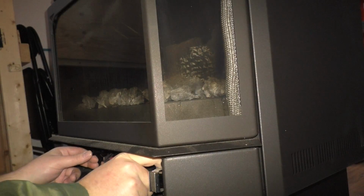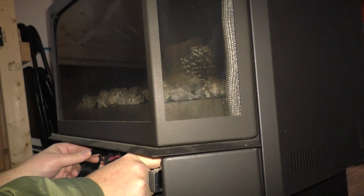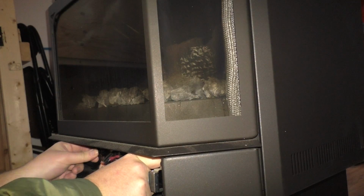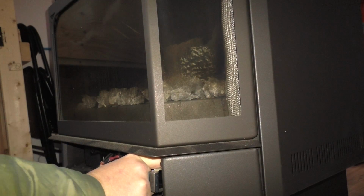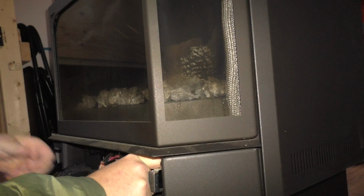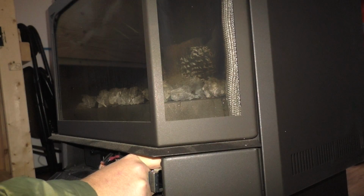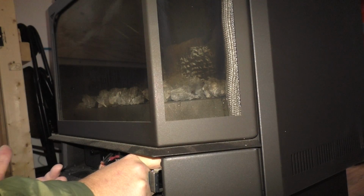So I'll hold the gas valve down, the pilot, the light, and then occasionally I'll strike it with the sparker until I see some action going on. Or actually hear it. Okay, saw that. I'm lit. You guys won't be able to hear it because of the noisy fans. So I'm just going to hold the gas valve down now to make sure the pilot stays on for a little bit. Then release the pilot and turn this to on.